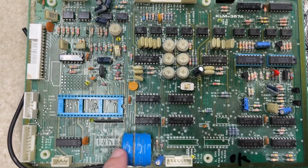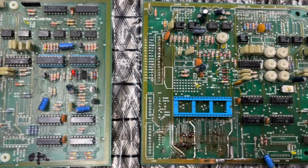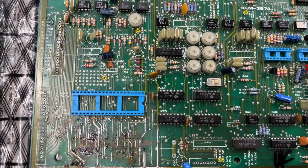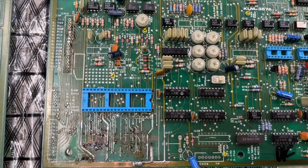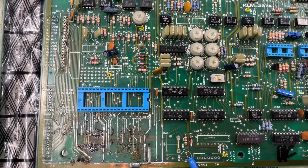And then I've got a couple of boards here. So the first one is where the battery sits, and then the second one is a picture of a board with the battery removed, but you can see the residual damage left behind. So this was really an Achilles heel for the Polysix, and has, I would suspect, taken many, many of them out of service over the years. There are some ways around that at this point. There's a few different companies that make aftermarket replacements.